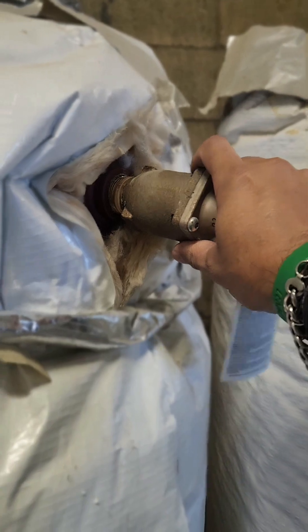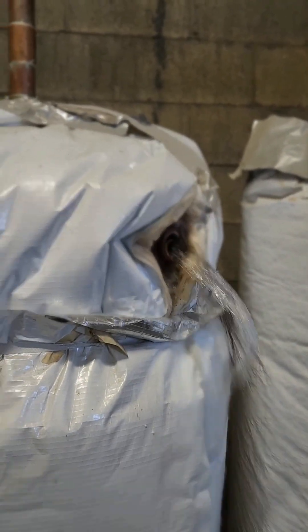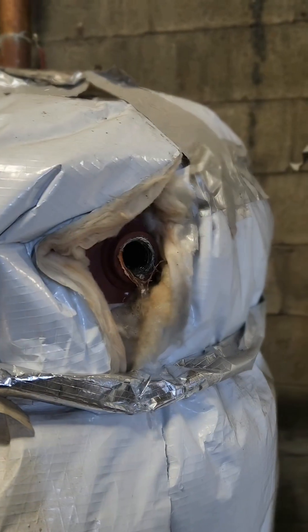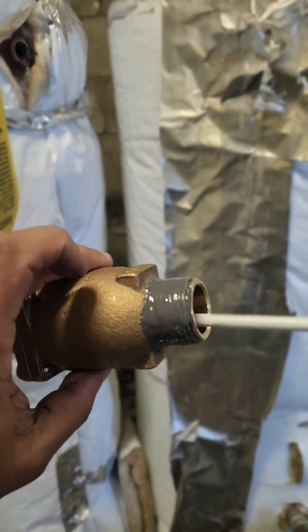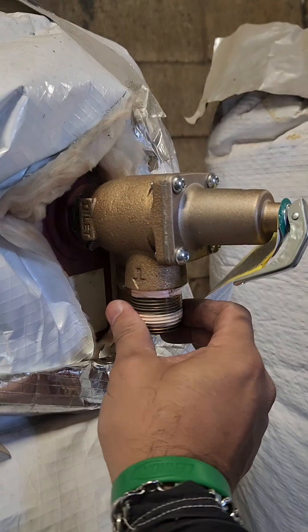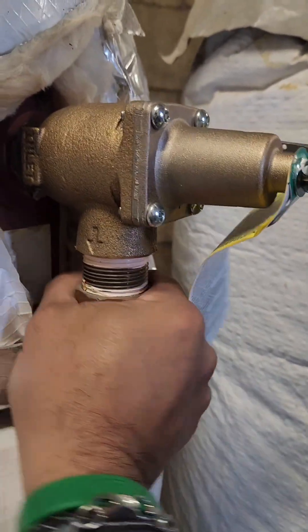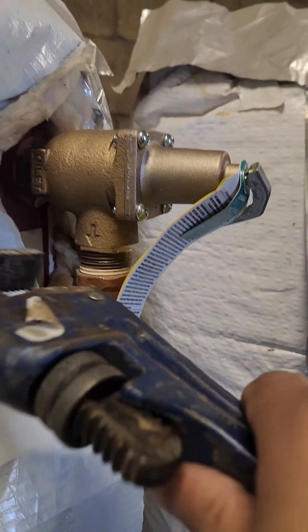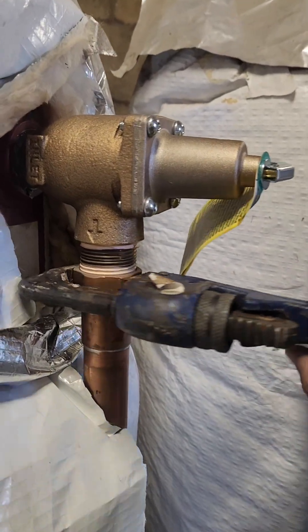So my TNP is almost loose — make sure to just jiggle it and see there is no pressure. It happens, so don't worry about it. Once the pressure is stable, it won't go. See, the water is stopped now. So this is my new PRV — T-tape first, then dope it, and slide it in. I put the new one in. Now I'm going to attach the termination. I attach my termination and I'm going to tighten it with my wrench. Start tightening it — don't go so crazy, otherwise the threads go bad.